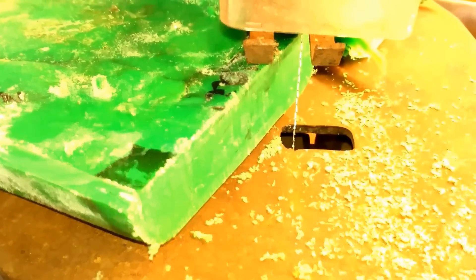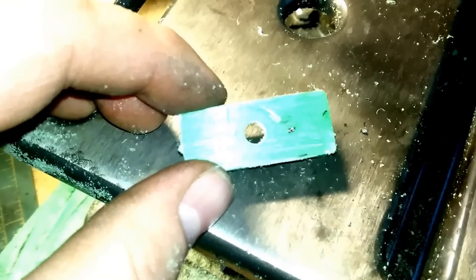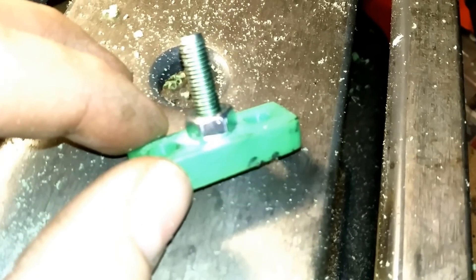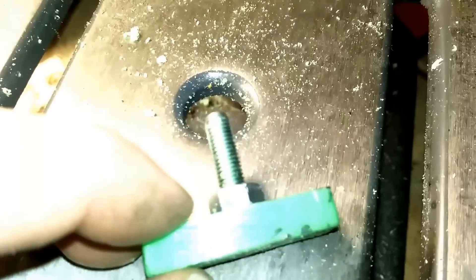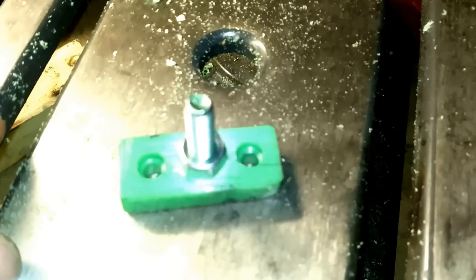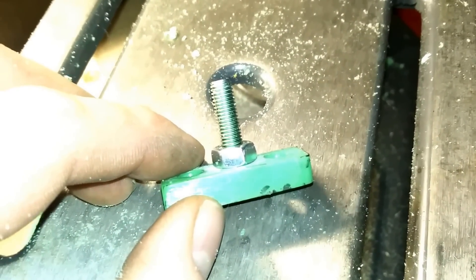The first cut shows it's a pretty solid piece all the way through with no noticeable air bubbles. I cut out a little block, drilled a small hole in the top the width of a bolt, and did a bigger hole in the back to countersink the head. Then I made a plug to go over the top to isolate it from grounding against the frame. The screws are recessed below the level of the plastic so there's no chance of a wire shorting on the screw tops. The plug in the back is glued in. These things cost four or five bucks online — if you can make them yourself, why wouldn't you?